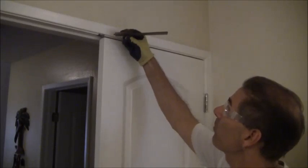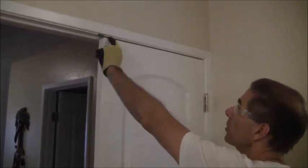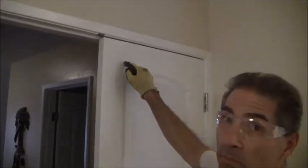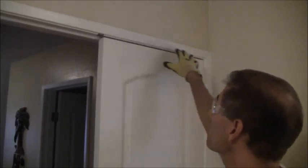I'd prefer not to have more than 1/8 of an inch. So I want to move the door higher on the top side by at least 1/16 of an inch compared to this existing door. Since I'm using this door as a template, this measurement here is critical for me to determine how much to cut the other door. So that's why I wanted to put it in place to see exactly how this is lining up. I also pulled off the door hardware, so this way I can lay it down directly on top of the replacement door. So I'm going to do that right now.